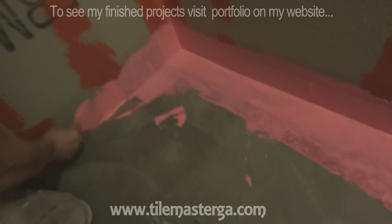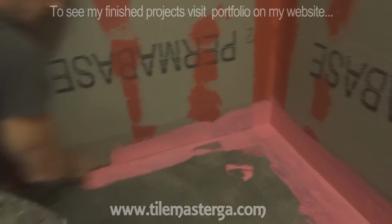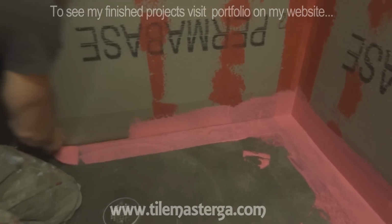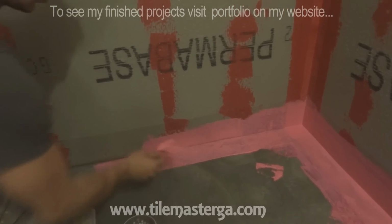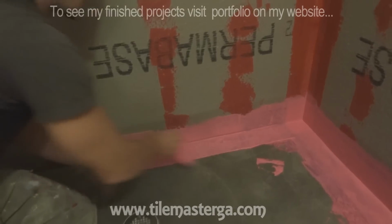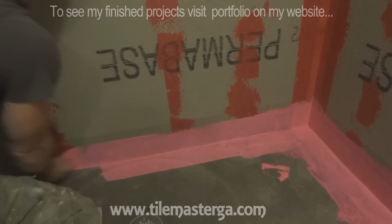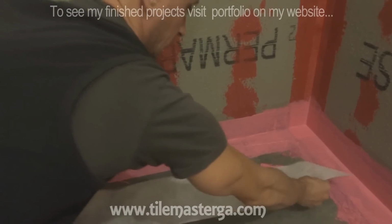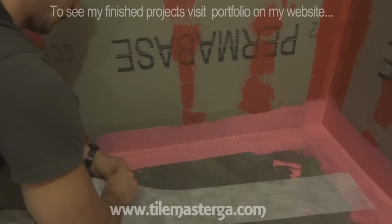So we will apply all this membrane on top of the concrete, on top of the main floor, and again corners. Once again, you can apply it the way I'm applying it right now. It's the best tool to do it for the corners. For most of the flat surface, you can easily use a roller brush with a roller, and it will work just fine too.